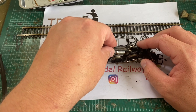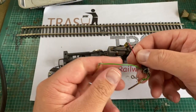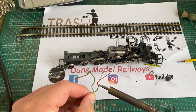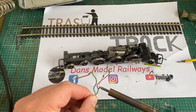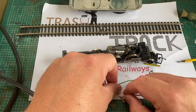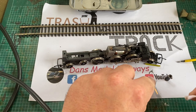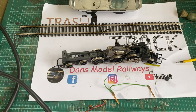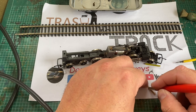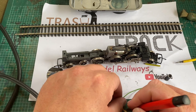To replace the motor just push the front locating clips into the holes and engage the worm gear into the front gear wheel. Now looking at the wiring loom, we need to keep the green wires with the pickups on and the red wire with the hoop that connects to the screw holding the motor in place — these provide the pickups for the decoder wires. Once unsoldered, give the pickups a good clean with cotton bud and meths, then burnish them with the fiberglass brush to ensure they are squeaky clean and ready to pick up current from the wheel backs.